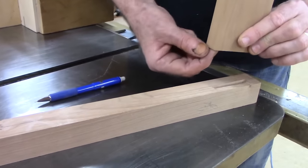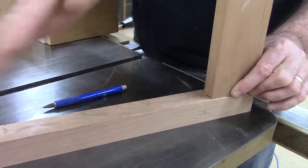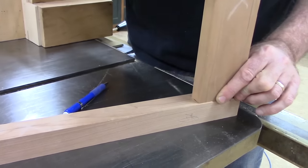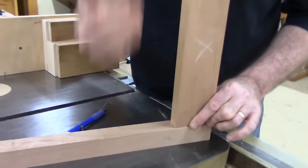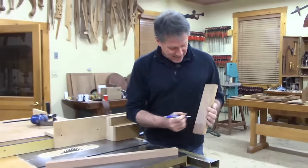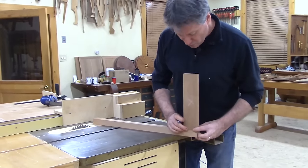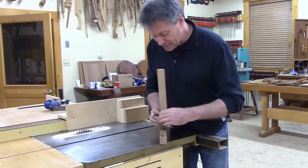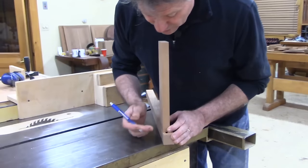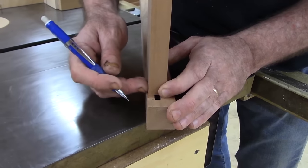You don't really need to be precise about the bottom offset — it's underneath the rail, so even if you missed slightly and had a little gap, it's no big deal. I'm going to offset the tenon by 3/32nds of an inch — 1/16th always seems not enough and 1/8th seems like too much, so I landed right there. So I'll take my pencil and make a little mark right on that side of the tenon. Then I'll set up my saw.